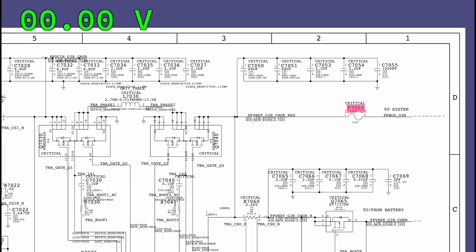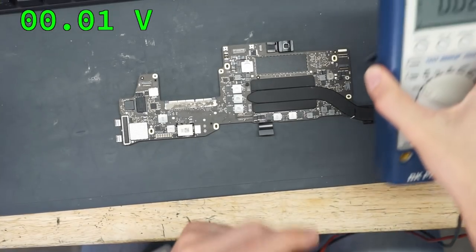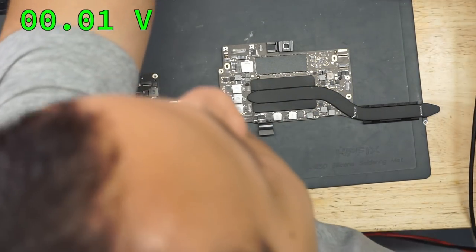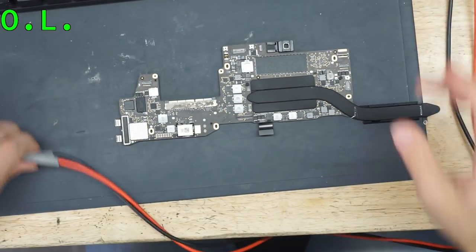So the reason they call it a short circuit is instead of being able to make the long path and go through all the things it's supposed to go through in the computer, it stops short over here and dies and doesn't make its way to the rest of the computer. And the way you can measure if you have a short circuit to ground is by putting your multimeter over here into ohms mode. This is my meter. I'm going to put it to ohms mode. I'm going to plug it back into my little serial reader over here so that the computer can see what I see.